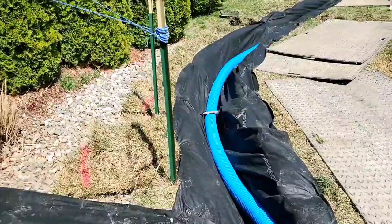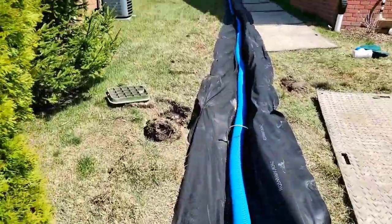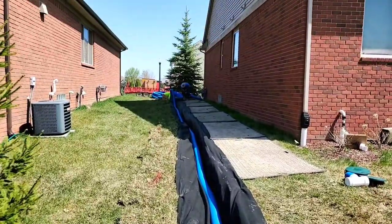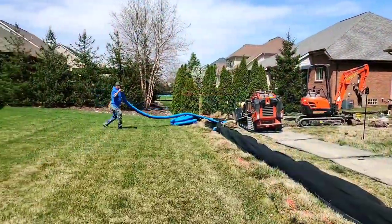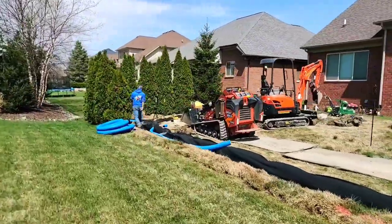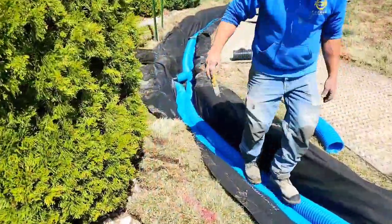Make sure you do the side lot along with the back of the lot. If you're going to do a perimeter drain, it's really important to grab everything up in between the houses too. Don't let the water sit there between the houses — it can't find its way out and it can't run through turf grass. Water needs a lot of slope to be able to move through turf grass.